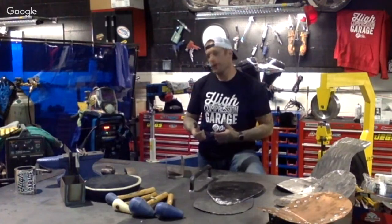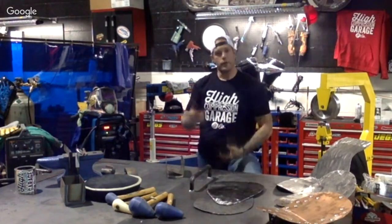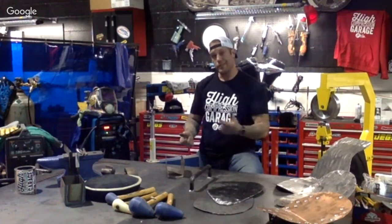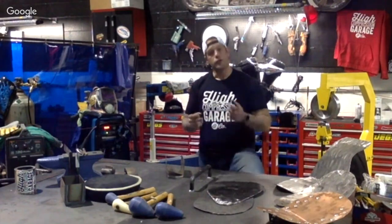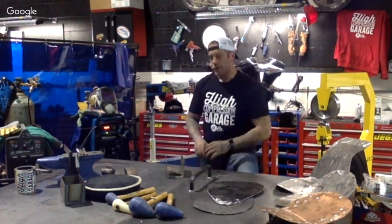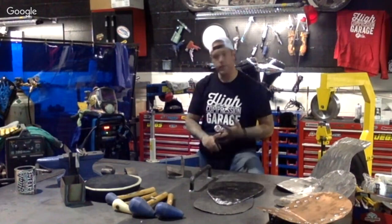because we can control that weld a lot more. With TIG, it can be a little bit harder, due to the fact that you have a foot pedal or a finger trigger. You've got filler metal at the same time, and you have to watch the metal at the pace it's burning and make sure you're filling enough metal in there along the way. There's a lot more to it, with choosing your correct tungsten and the correct filler metal.